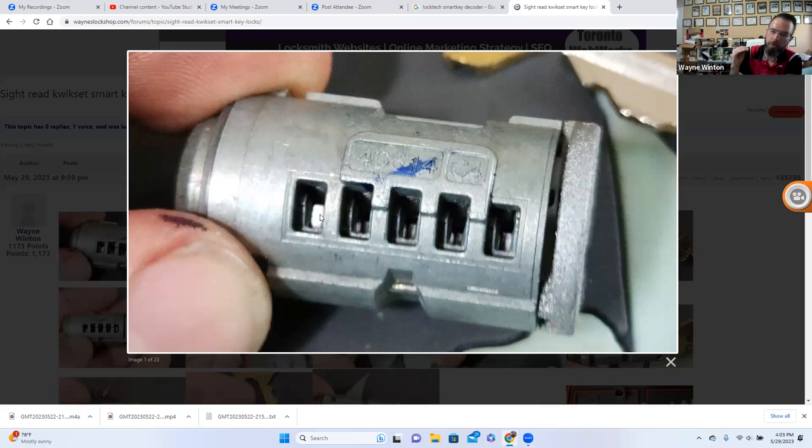When you stick a key blank in and look at it from the top side, that registers in my mind as it needs to be cut this much to fit so that it falls into place. When you look at it backwards, it would be a backwards cut. Your deepest cuts would then be your highest peaks. I'm not trying to confuse people. I'm just saying I personally choose to use a key blank.